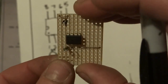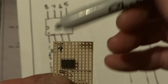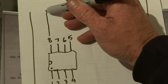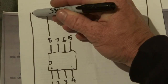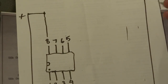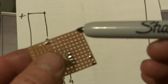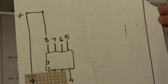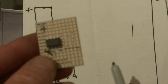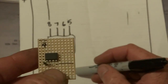It'll basically go like that. Then what you do with the pins you chop off on the bottom — you'll need to connect from number eight. The track that comes off up the top — you need to connect the cut-off pins to the furthest track that runs on that side, as that will be the positive. The one that runs on the other side will be the negative. You can use wire to go from there to there, and from number four you want another pin that goes from number four to the negative.